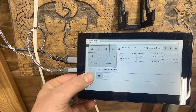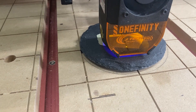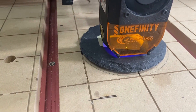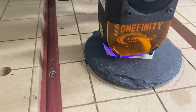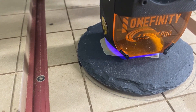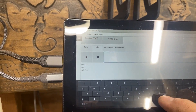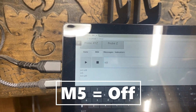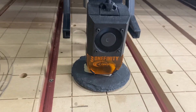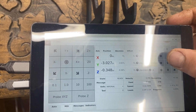There is that very faint laser. Now I'll use the joy pad and jog this back in space until I find my center mark — you can see it right there, about a quarter inch over. And that's it — I'm right on top of my center mark. I'll come back to the controller, type M5 — that's the command to turn the laser off — hit enter, then hit play, and now the laser is off.